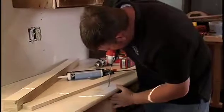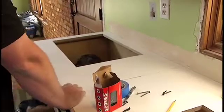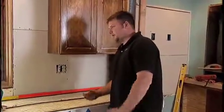So first things first, we needed to get the form set up. On this particular one, we use 3/4 inch melamine, which has a coating that will not let the water penetrate into the wood, or you could use plywood, but you would have to cover it with plastic. The reason for that is it would suck the water out of the concrete, causing it to crack.